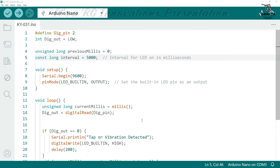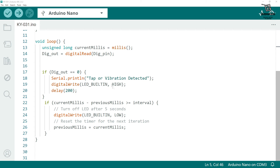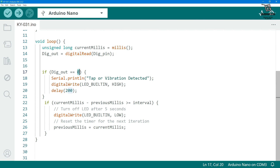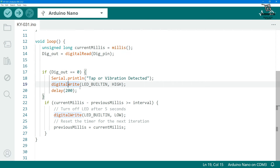There are three pins: the output pin, the 5V pin, and the ground pin. The circuit connects 5V and ground from the Arduino, with the output pin connected to digital pin 3. Unlike the previous two modules, the KY031 has no additional circuitry — it only has a pull-up resistor that keeps the output high when inactive, making it an active low device.